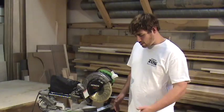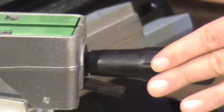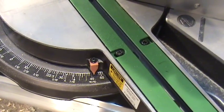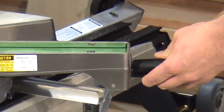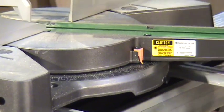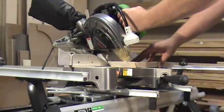In order to move the bevel, simply lift the lever with your finger and the tool will slide easily. Releasing the lever will stop it at each one of those angles. However, if you're trying to lock the position at an arbitrary angle, such as 26.5 degrees, set the saw using the scale, which is very accurate, and twist the handle. That's going to lock the saw at any angle you could possibly want — infinite adjustment, wherever you need it.